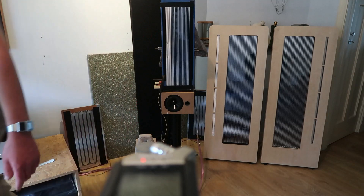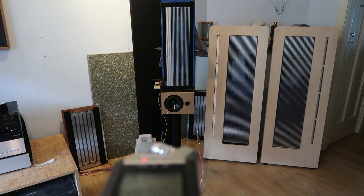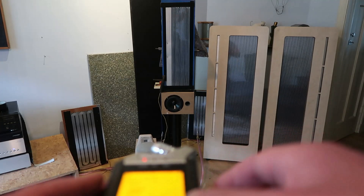It's been a fun learning exercise. I've learned why some dips are there and how to counter them. It's not completely flat still — it's hard when you have this size of tweeter. A smaller tweeter is easier to get flat. The height of the measuring microphone also influences how the curve looks. All measurements were taken roughly in the middle, but not exactly, and slightly to the right — so not even straight on-axis with the tweeter. Anyway, let's play a song and then leave it at that.